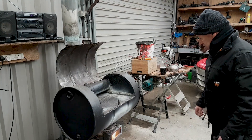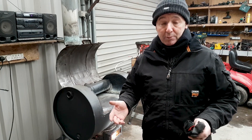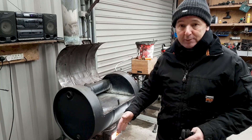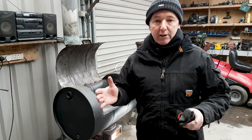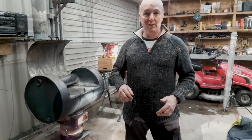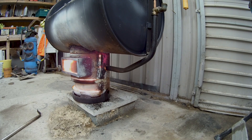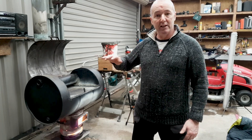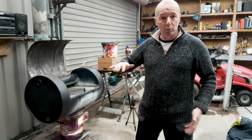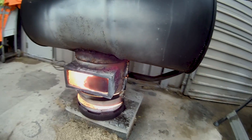It's very hot - it's burned part of the glass partly clean. This is a great little burner. I know it's a bit of a Frankenstein - oil drum, propane bottle and all of that - but it could have been made to work on either of them no problem. The reason for this was I wanted to be able to cook on it, heat plates, brake discs, bearings, or whatever. It's absolutely hammering out heat, which is fantastic. So I'm out in my shed, the Frankenstove is working absolutely brilliantly without the burner - fewer parts in play and absolutely hammering out heat. And as I showed a few minutes ago, there's zero smoke on the roof. When you're building up temperature there might be a little smoke, but once you get it up to temperature there's no smoke.